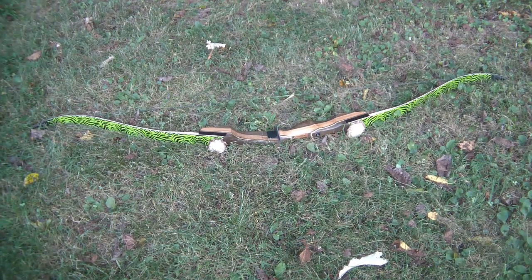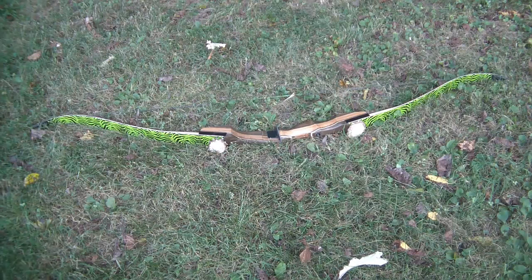It also handles the stress of being strung and pulled back to full draw. You want to make sure that you only drill your hole deep enough in each antler bud to have it sit flush with the head of the screw, with the washer sitting on top, to ensure that the pressure is only on the bolt — not on the antler bud — to where the limb would actually force the antler bud off the end of the bolt.